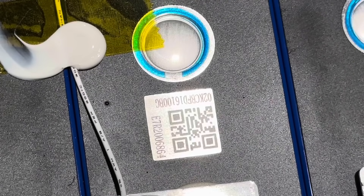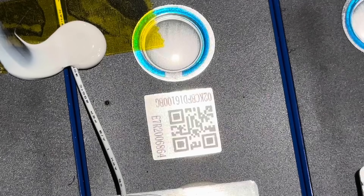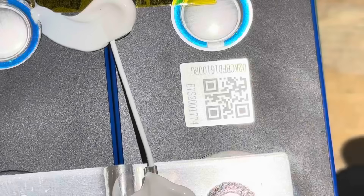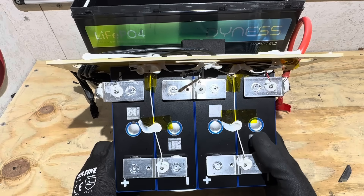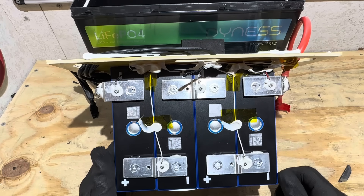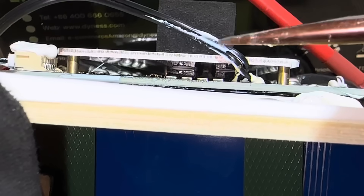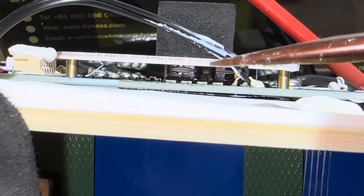Here's a shot of one of the QR codes on the cells, and here's another one on a different cell. I scanned them and the cells have a valid QR code that comes up in the database — they are made by Great Power. I've seen other batteries with these cells and they seem to do well. Also, if you look down between the heat sink and the actual board on the BMS, you'll see two wire leaves — that is a high temp thermal switch on the BMS, which all the Cyhangs have.